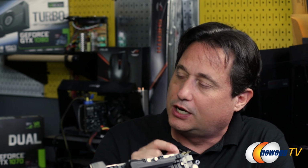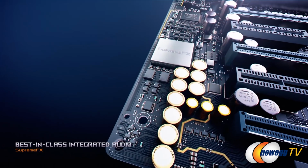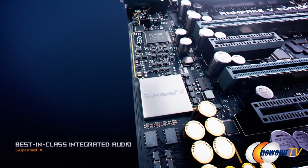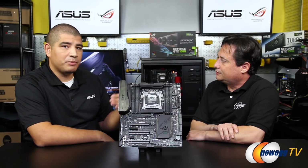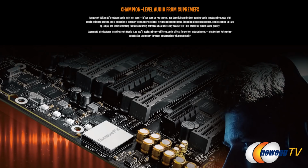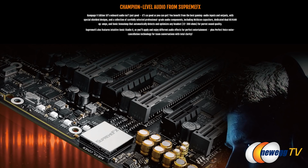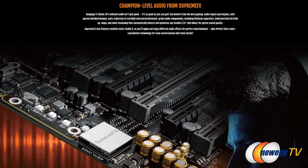Another defining characteristic of what makes a board an enthusiast level board is the quality of the audio that's on it. So tell us a little bit about that. We've got a really special audio design here. It's SupremeFX. So this is something we've continually progressed in year after year. We really set the industry trend in terms of this design. Pretty much every major motherboard manufacturer has now implemented our type of audio design, where we have an isolated audio path, we have premium audio components like audio grade capacitors, and an operational amplifier which helps to give you punch and better driving strength for your headphones.